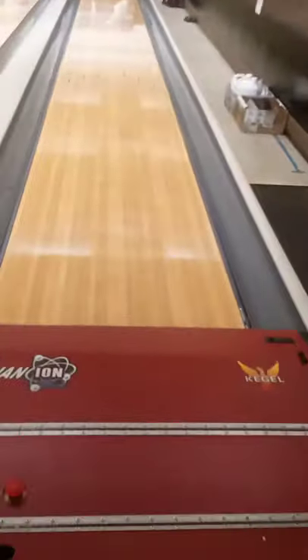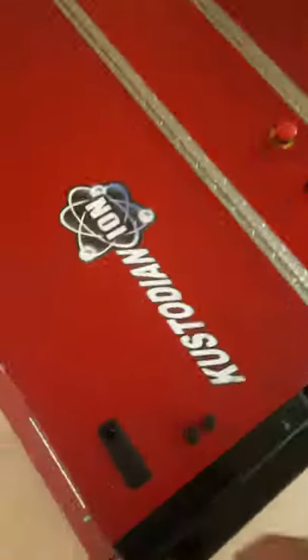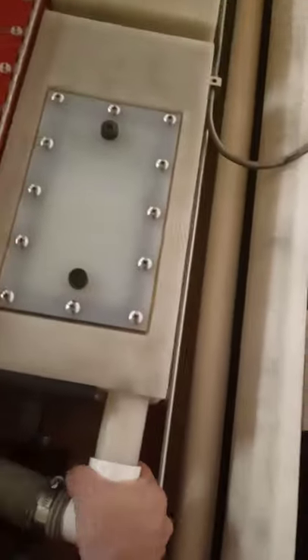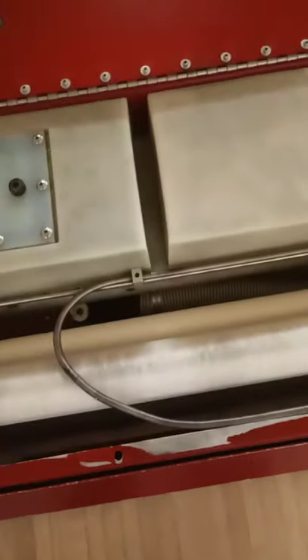So we will shut it off, press the button in, pull the cover down, and pull the machine out of the lane. Then these two latches come up, top flips open, and that container gets separated right here, and then you just empty this from the empty side. That's it — put it back in and take the machine to the back and plug it back in so it's charging. Make sure you clean the duster liner and the cleaning brush in the back.